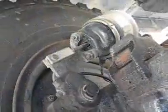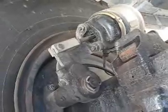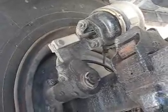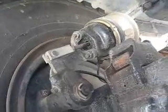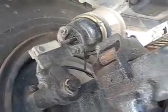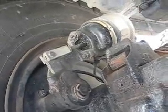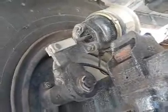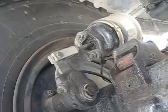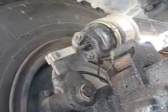Here you see one of the new brake actuators. The European regulations say that a secondary braking system must be applied to at least two axles. So we did the back two axles with new actuators, which are dual circuit. It's called a spring brake because the brakes are normally on, and you need air in the secondary system to drive them off when you release the deadman switch.